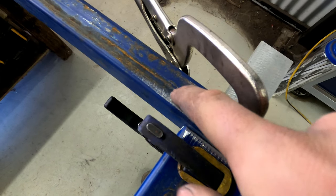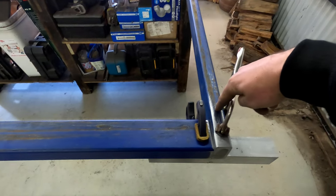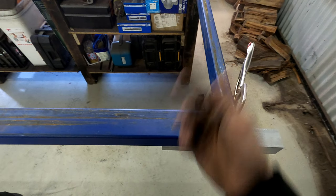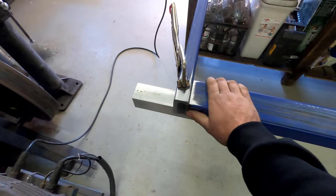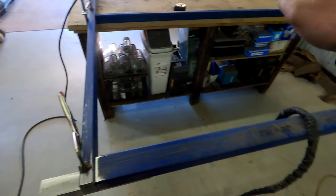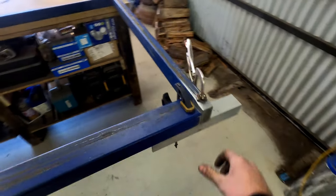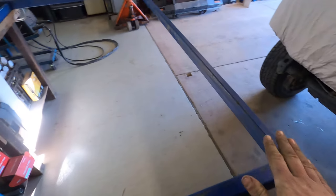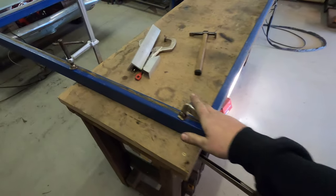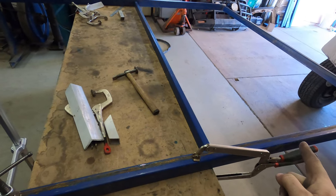You can see that funky little line — that's the seam of the tube. On every piece going into this tray I've considered where the seam is, so that seam is currently on the bottom. This tray has to flip over. I've clamped some angles and got it all lined up nicely. I'm only going to tack the corners on all four sides, then play with the diagonal, get it square and clamped down tight. The front and back rails are now tacked in with four clamps.